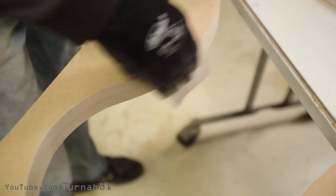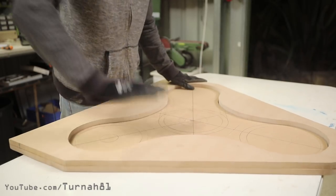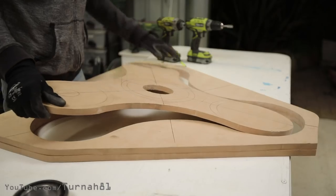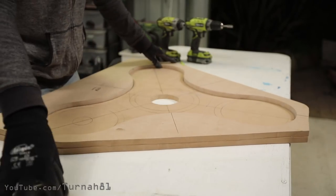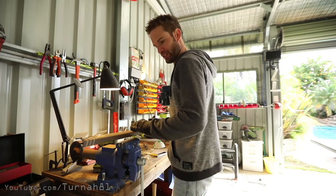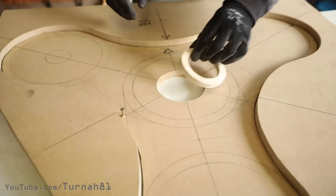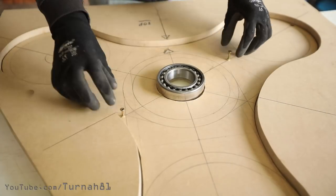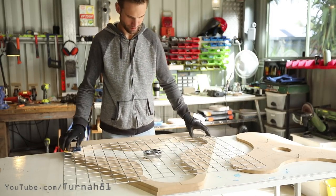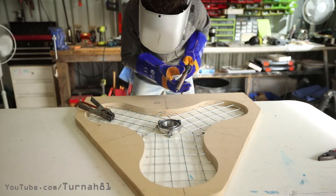I've never molded concrete before, just thought I should have disclosed that. To make sure the bearing is nice and centered I'm going to use the piece I cut out earlier as a jig, which drops nicely into place. Now while you were distracted with that fire I cut a hole for the bearing in the middle of the jig. With the addition of a couple of screws I can lift the wood away and leave the bearing in the middle undisturbed. To reinforce the concrete I'm going to use steel mesh and steel rod throughout — not only will it make the concrete a lot stronger, it will allow me to make some retainers to keep the bearing in place. Once the bearing is in place I can start to cut out my mesh to provide the reinforcement. I've tried to keep this as symmetrical as possible to keep everything nice and balanced. Then there's just a little bit of welding to keep everything in place, and I've bent some of the ends of the mesh so it doesn't sit flat on the table but instead sits in the middle of the slab providing maximum strength.